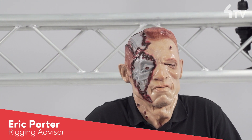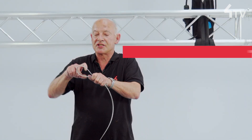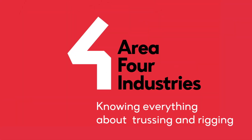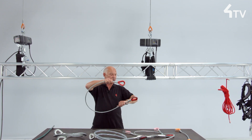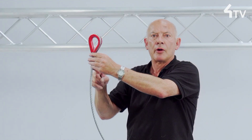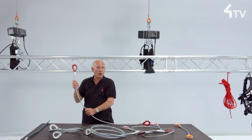I need to talk of terminations. For riggers, wire rope is of little use itself unless it has terminations — the ability to form an attachment point. Most often we're working with 10mm diameter cables terminated by aluminium cold pressed ferrules to trap a loop of wire rope around a thimble, a so-called hard-eye sling.